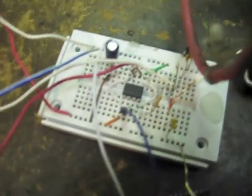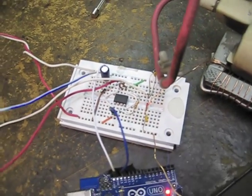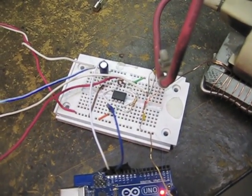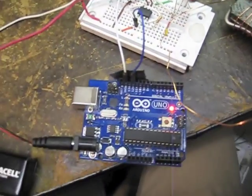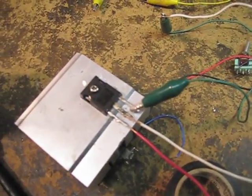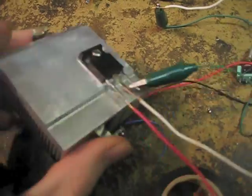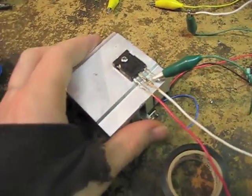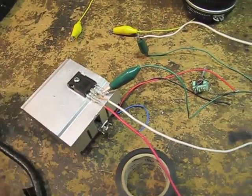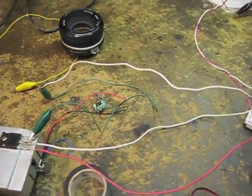Here's the circuit that I use to run the thing. On a breadboard right now, I just have the MOSFET driver and a couple capacitors and diodes, and all that basically takes the signal from the Arduino and sends it to this MOSFET right here. I have it on a heat sink — it's a really big heat sink but kind of unnecessary because it doesn't get that hot. You just can't run it for a long time; that's bad for the transistor.